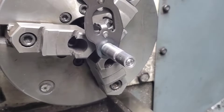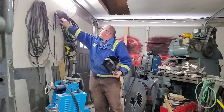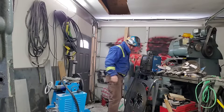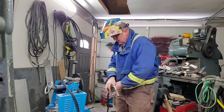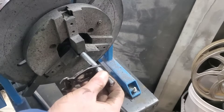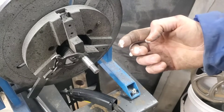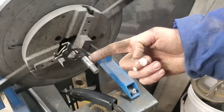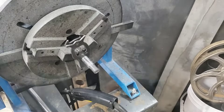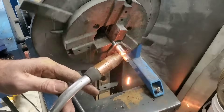Out in the welding shop I've got the welding positioner, and man — this welding positioner is worth its weight in gold. We all know how it ends when you weld in the lathe: you're gonna mess up the bearings. To prevent spatter from sticking on the shaft, I grabbed cooking oil from the kitchen, and it actually stops the spatter from sticking on the shaft. My shop smelled pretty good when we were done welding.